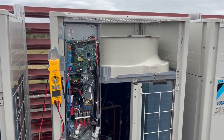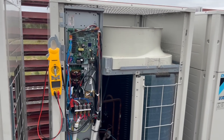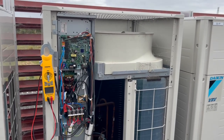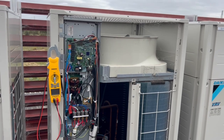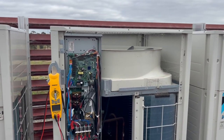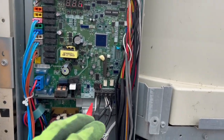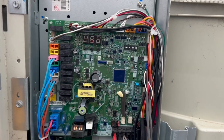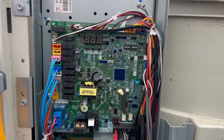Unfortunately, this system does the bottom floor on a two-story building and I'm on the roof, so hopefully we don't have a break in the wire. I'm going to reapply power and see what happens to this control board. Just reapply power - my first check is the comms voltage output from this board, which should be 16.5 volts DC.